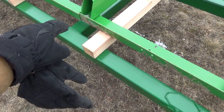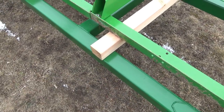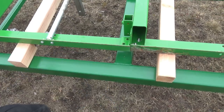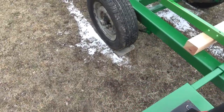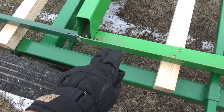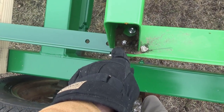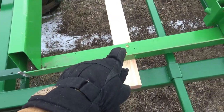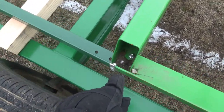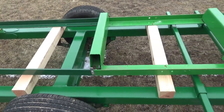I'm going to need something long enough to go through all the way down — I'm actually thinking about a squared-off U-bolt if I can find something that long. I don't want to drill into my frame if I don't have to. I need to get this flush. The new part — because of what Harbor Freight did, they took normal angle iron and ground it flat. The new piece that was made won't mate up flush with the top, so I'm going to have to raise the original mill frame on washers to mate up to the top so I don't have a bump in my lumber.